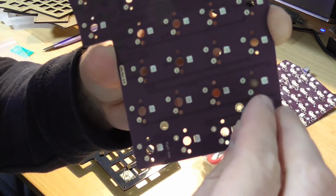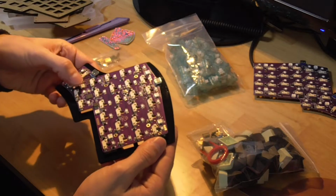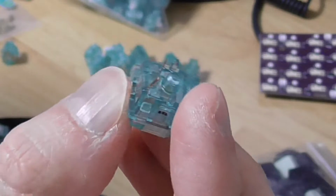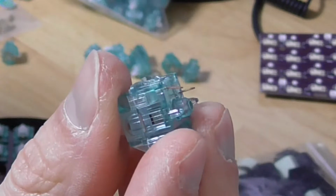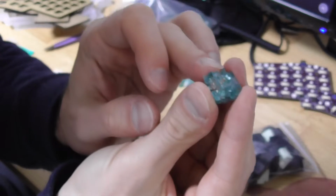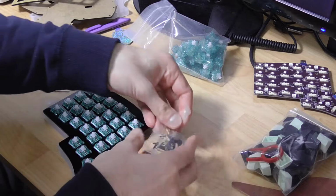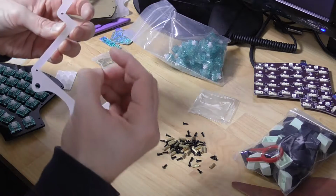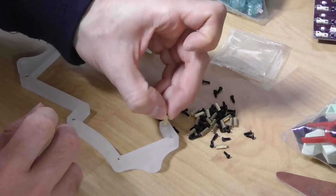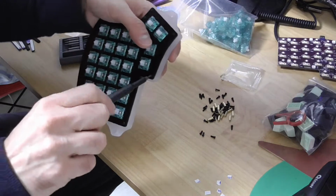how they go in. So you have to make sure that the metal pins are straight when you try to do it, especially when we are going through the acrylic board. So if the pins are a bit crooked, then you have to try to make them straight, maybe using your fingers or like a tweezer or something, and then you can proceed inserting them into the board. So once the board is finished, we need to put these small metallic things into the middle acrylic plate, so we can then screw in the screws into this.